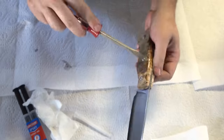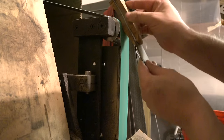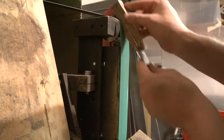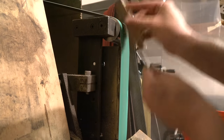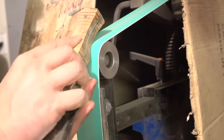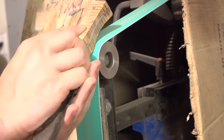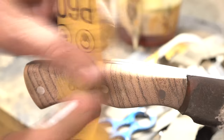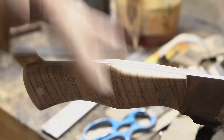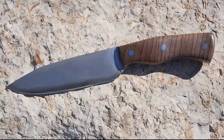These handles are cross-cut zebra wood. I like the look. Zebra wood is a bit of a soft wood — I don't know really how durable it is, but this is probably a little bit more of a decorative piece, and it certainly fits the bill for that. I took it to 800 grit and then it's into the Danish oil overnight.